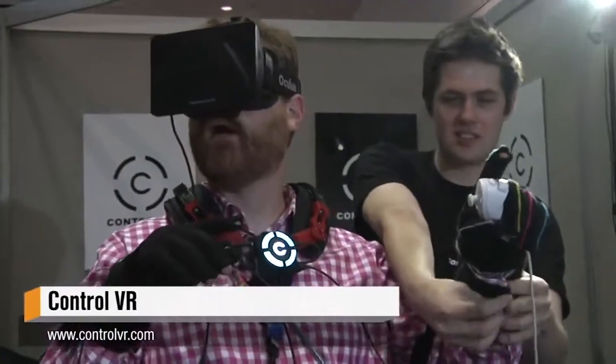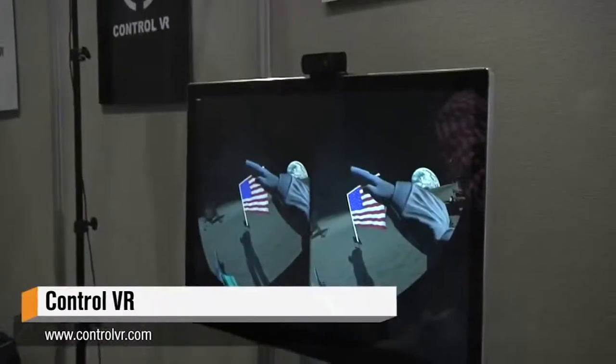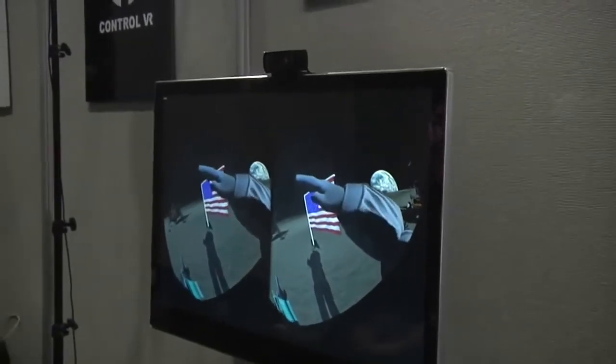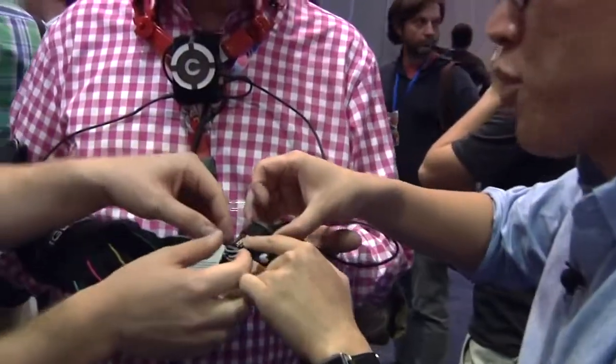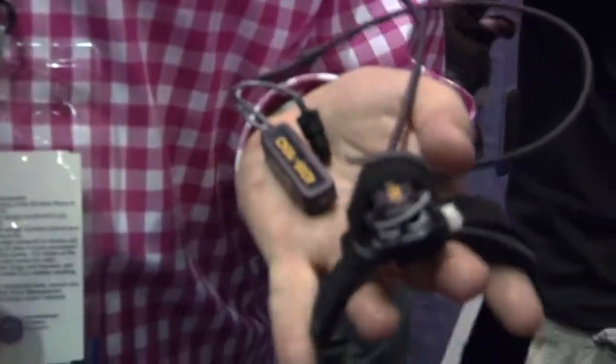Our system — what we wanted to do when we introduced motion to VR gaming is we wanted to make sure we had full motion. We wanted to make sure it wasn't just limited to a field of view of a camera. We wanted it so you could go behind your back. And ultimately that's because of social — we wanted to be in a place where you could very easily communicate with others, basically reintroduce nonverbal communication to gaming. So what we've created is a forward kinematic system. It uses 19 IMU sensors — modules with a system of accelerometers, gyros, and magnetometers. The magnetometer is key because that's what keeps it drift-free. We initialize and it finds its north.